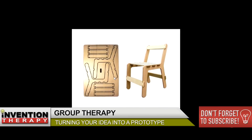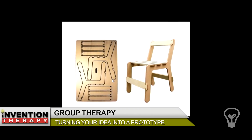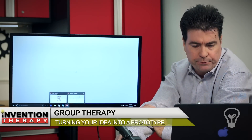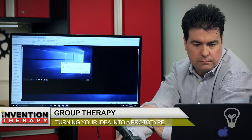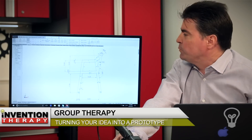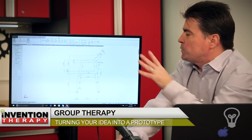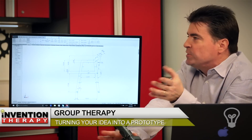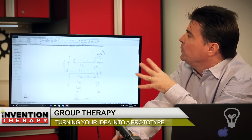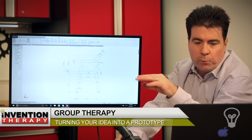So you lay a 4 by 8 sheet, the machine cuts it out, and this is fairly simple compared to our design. I've just given you an idea of what we're doing as we progress. So I drew the sketch — and if you check the other videos where I teach SOLIDWORKS, you'll see that you start with the sketch; everything is done in sketches. You need dimensions, you need lines. You can also do circles, splines which are really complex curves — there's a million different shapes you can do. But basically lines and circles is all you need to design most things.